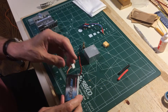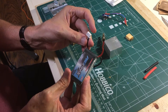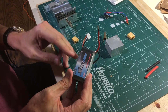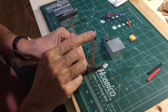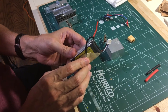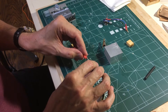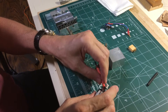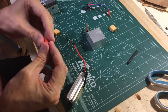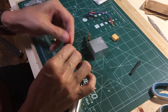Now we're going to solder the connectors to the battery. One thing to point out: this is the standard balanced charger connector — it plugs into a balancing board to safely recharge your LiPo batteries and has nothing to do with the installation operation. Because I've taken off the ends and these are exposed wires on a charged battery, I've taped the black one to the back so we're going to work one at a time. As before, we want to make sure we put on our heat shrink tubing before we do any soldering.